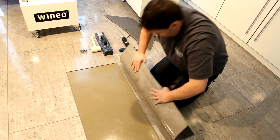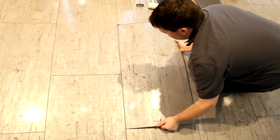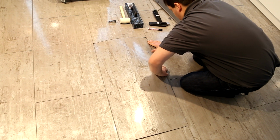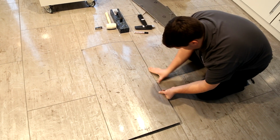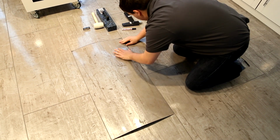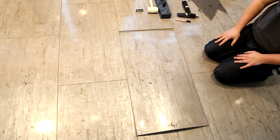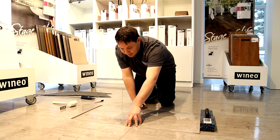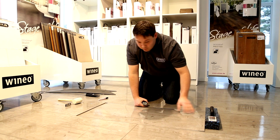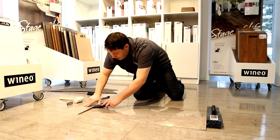Because the design flooring is made of an elastic material, we can easily deform it a little to lay it into the floor. We have locked the tile in place along its long side by bending it. To lock it in place along the short sides, we can take the sheath from the knife, the tapping block and the white rubber hammer and guide it under the push-down locking system with a few light knocks.